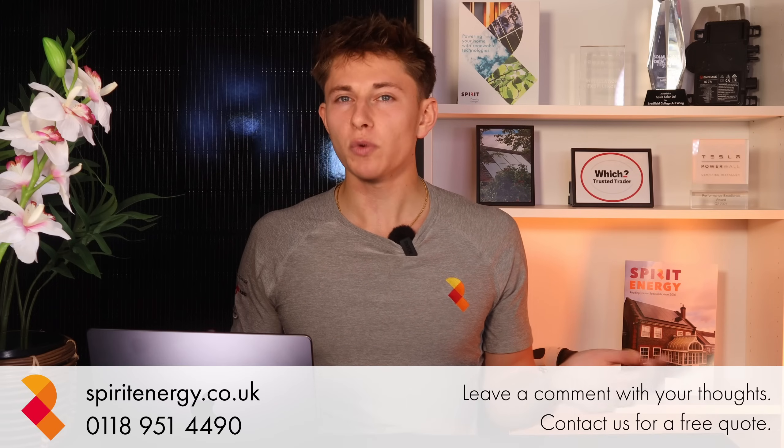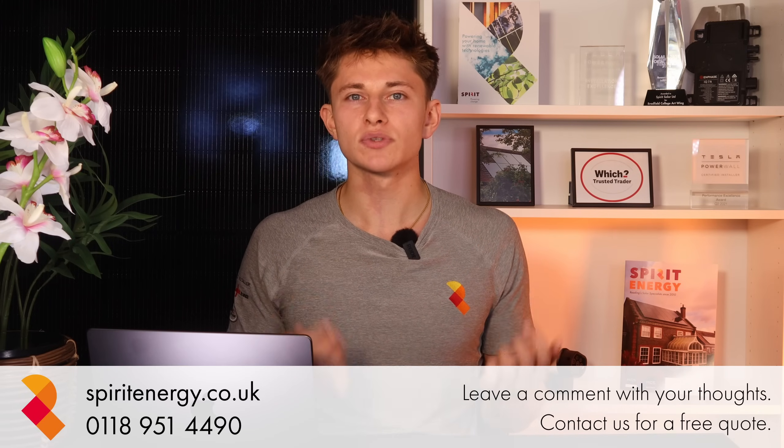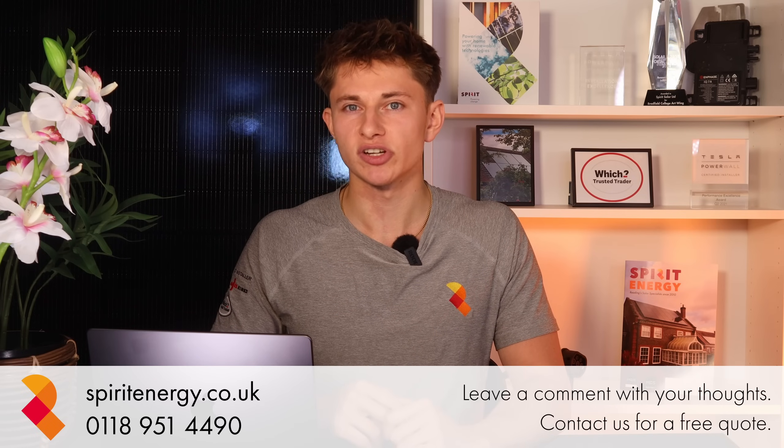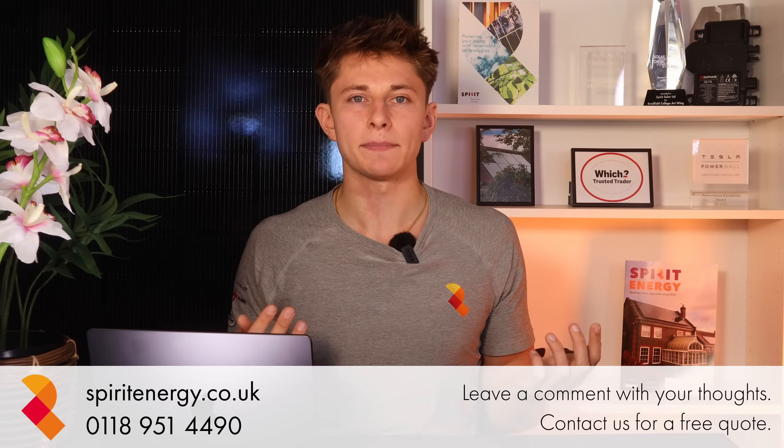So, the IKO Neostar 3 — is this the solar panel you should be considering for your roof? I'd say absolutely yes. It's leading the way in terms of module efficiency and IKO is helping to drive the industry forward with their new shade mitigation technology. If you aren't concerned about aesthetics, I'd certainly opt for the 3P range instead of the 3S range, as you'll get a better panel and pay about 10% less. Thanks for watching and do check out our other videos on solar panels and battery storage. If you're interested in a quotation for a solar and battery storage system, do get in touch with Spirit Energy.